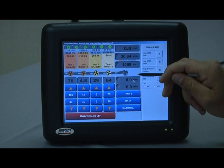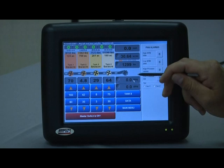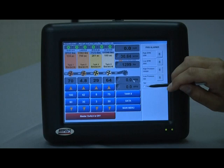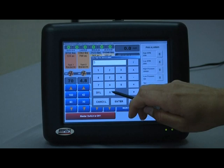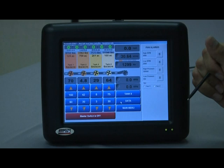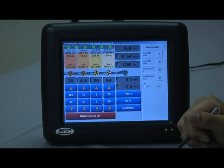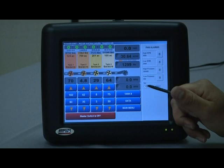The fan alarm settings for high and low RPM speed can be set in the side window — high RPM for fan 1 set individually by touching the calculator button, for example 5,000 RPM, and the same for low RPM. To set fan 2, switch the bubble over to fan 2 for a new set of parameters. The high and low pressure settings use the optional air pressure sensor; if you did not purchase that, these menus are of no use to you.